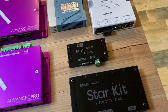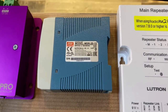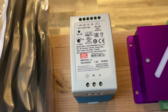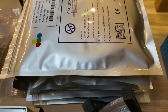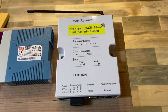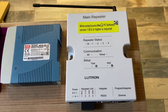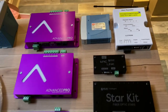Two items not shown: we have two DIN rail modules — one controls the power supply for the star kit (on/off), and a second DIN rail switch controls the 60-watt supply that turns on the pathway lighting into the stairs. Both sets of stairs have warm LED lights — in the pile of RGBW strips there's just a warm white/yellow for those. Also not shown is the Lutron Radio RA system for 232 control of the sconce lights and wall-washer lights via Lutron Radio RA dimmers — so there are basically four items not shown here.